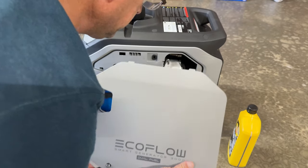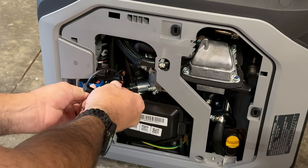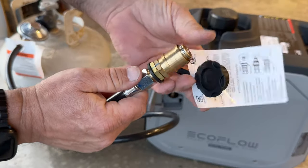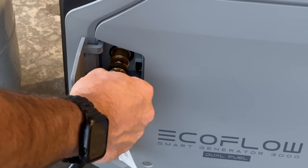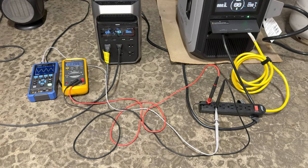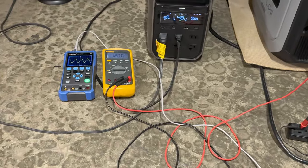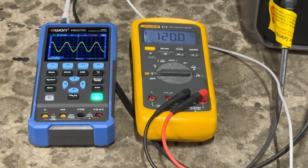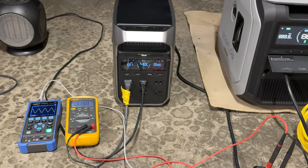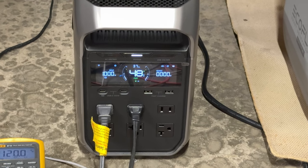It's finally time to get started on the generator. We're going to open it up — they don't come with oil, so you need to add some oil to it. We're going to hook up the battery, put the back together, hook up the propane, plug in the connector, and we're ready to get started. We have the power strip plugged into the left-hand side, powering the meter to tell us voltage and frequency. You can see we have a perfect sine wave. The battery system is just about ready to hit 50%, at which point the generator will shut down.